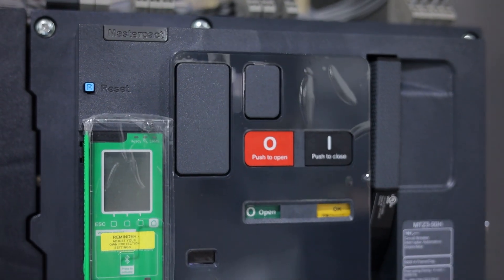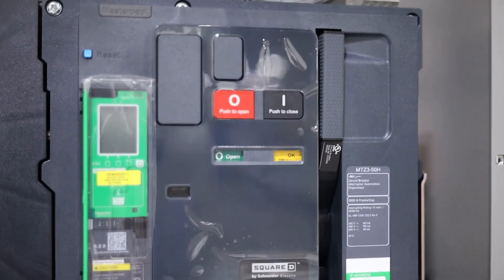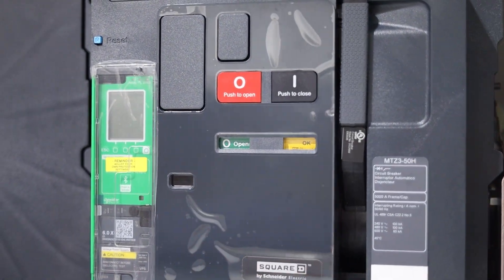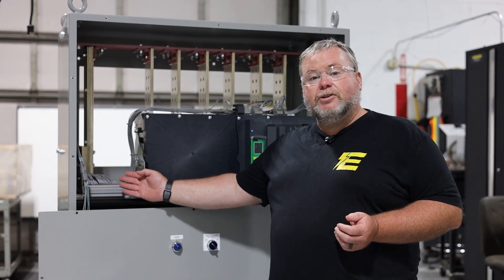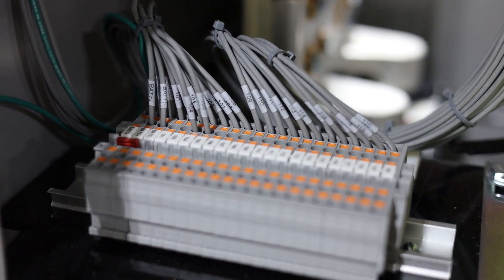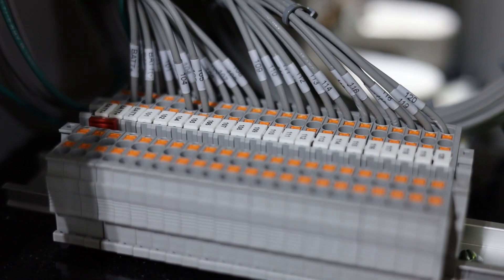After that, I will double check and make sure that the breaker itself opens and closes. It has a series of contacts on it that come out to our terminal board. I will use a multimeter on this and double check and make sure that these actually close and then open back up when the breaker is open and closed.